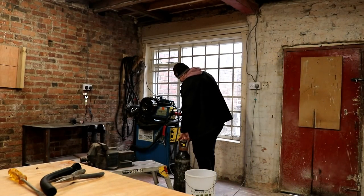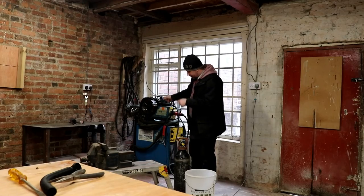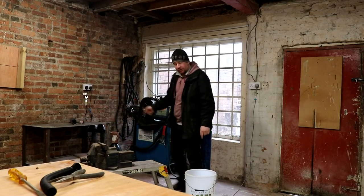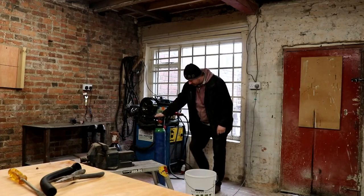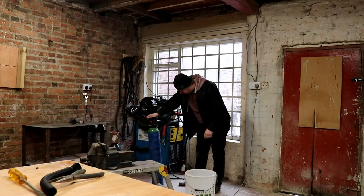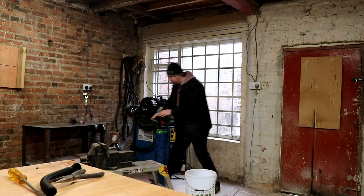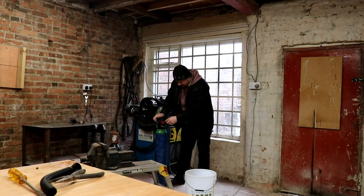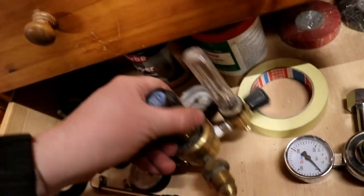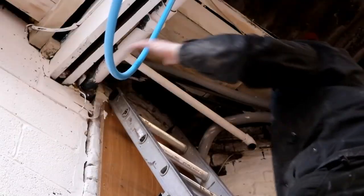Also picked up this gas - I think I mentioned it already. We've got a replacement CO2 cylinder for the one that I pinched and used on here, so I'll probably run that empty and then I've got an extra. And then this one is argon CO2 - it's got 5% CO2 in it, and I was told this is what I want for the MIG. I've just noticed though it's a completely different fitting so I'll have to change the regulator. I hope I've got a reg in here that'll do it - and it's got a flow meter on it. Bloody perfect, exactly what I need.